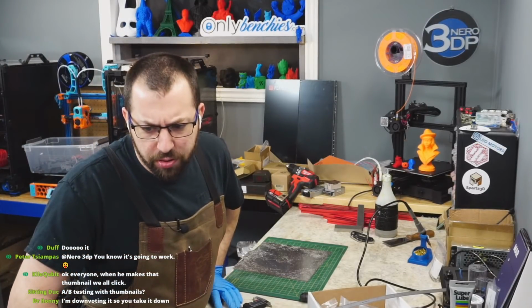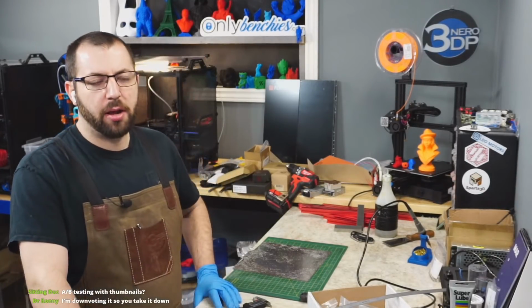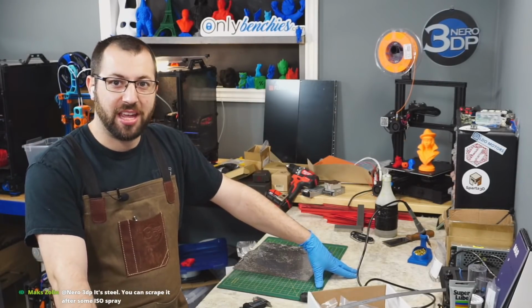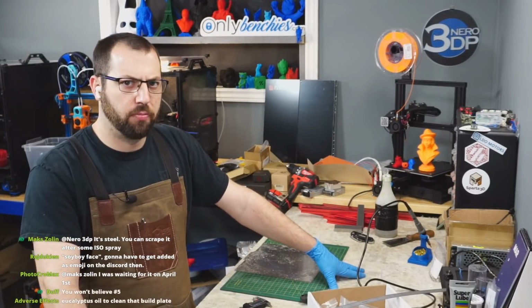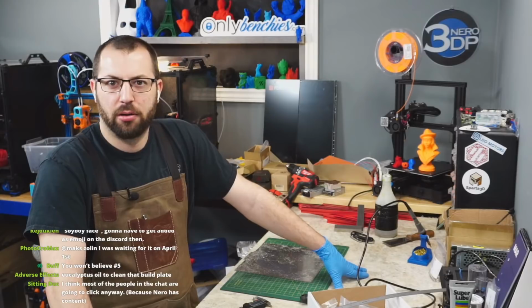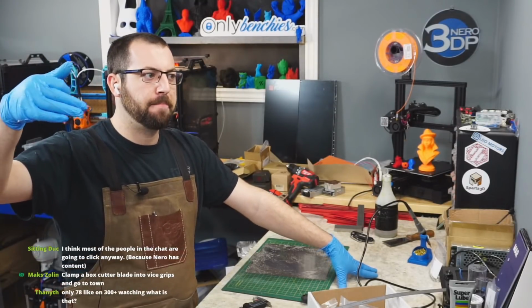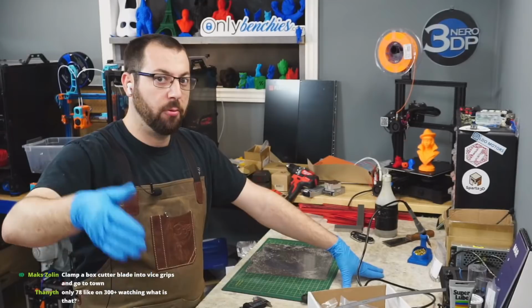In the bed with a thermocouple probe, both of them were about 10. Is there a way to adjust the offset? Not really, E2. When it comes to Eddie the Engineer, subscribe to his channel. He did a video breaking down probes, like the temperature probes that 3D printers use, and there is variance. Even Slice's 450C rated, like $50 probe has a swing of like 30 to 40 degrees Celsius. No probes are that accurate at what we're using. They're consistent though. So your probe might always read 30 degrees lower, but it will always be the same. But when you compare probe to probe, one probe may read right on and one might be 20 degrees lower.